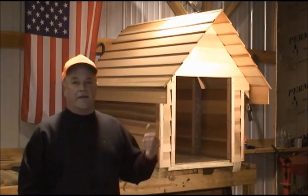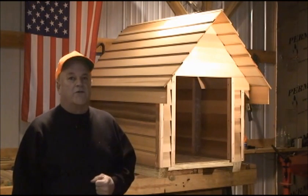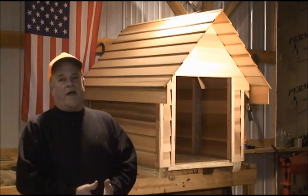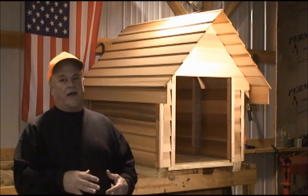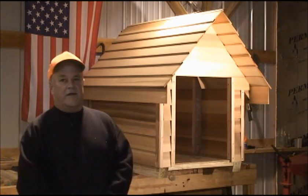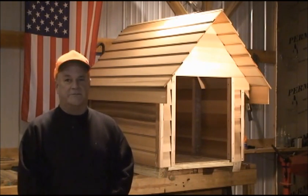Hi, I'm Ted. And this is a cedar-sided doghouse. It's got a Douglas Fir 2x4 frame. Now the cedar siding is beveled. It's 1/2 inch by 6. Little plywood floor and sitting on 4x4 pressure-treated skids. I built it for around $125. I'll show you how I did it.